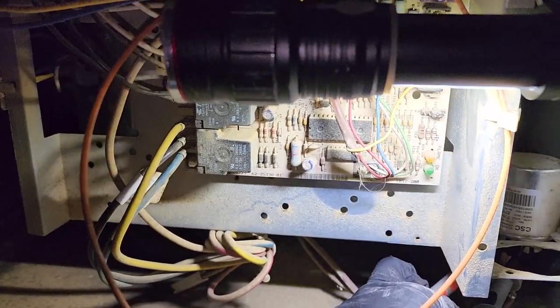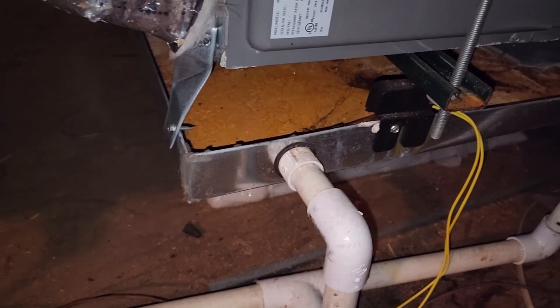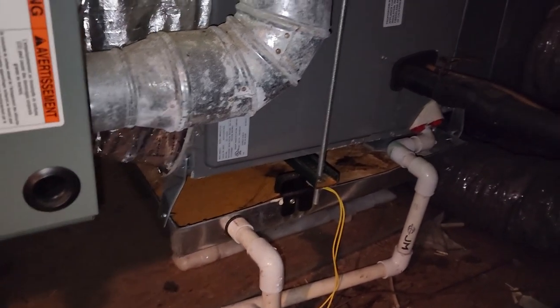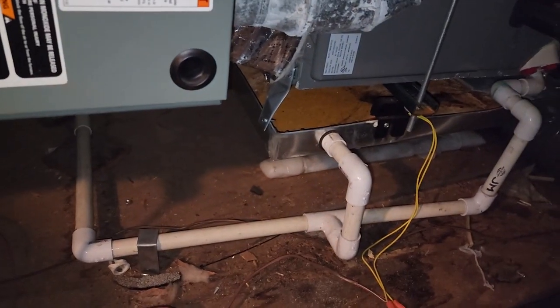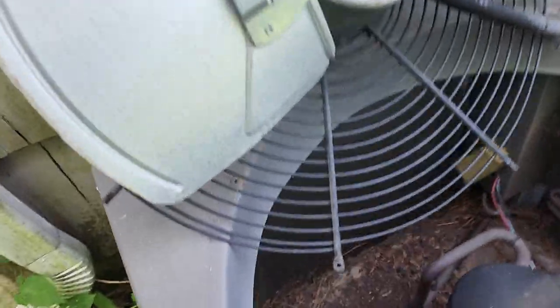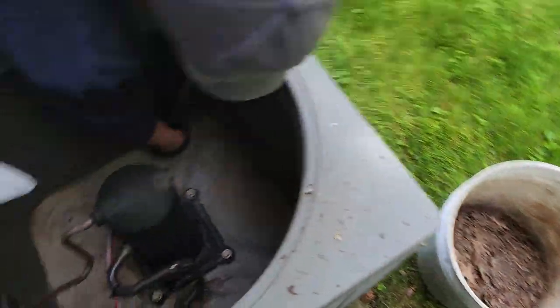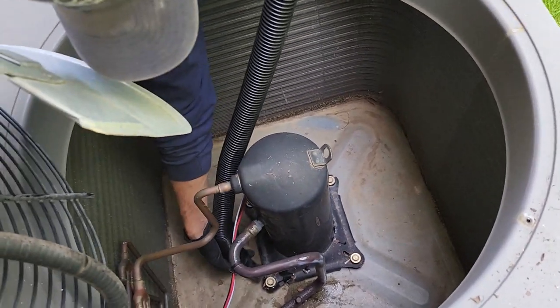He really just wants to make sure they're working. And again we have a coil with another furnace by Rheem — checking everything out the same here. There is evidence of water being in the pan. The units have been running and it's dry right now, so I'm not concerned about a leak. I'll see if he'd like me to blow out the drain line or install a union so I could blow out the drain line. Peter is grabbing me a bucket because I'm going to clean the inside of these out. The coils don't look too bad, a little corroded on the outside, but electrically everything is testing fine. I'm cleaning out this one and that one as well, just to get some of that debris out of the way. Holding the fan up while Peter vacuums out the looser debris — we just want to make sure that water doesn't sit down there and can flow through the drains.